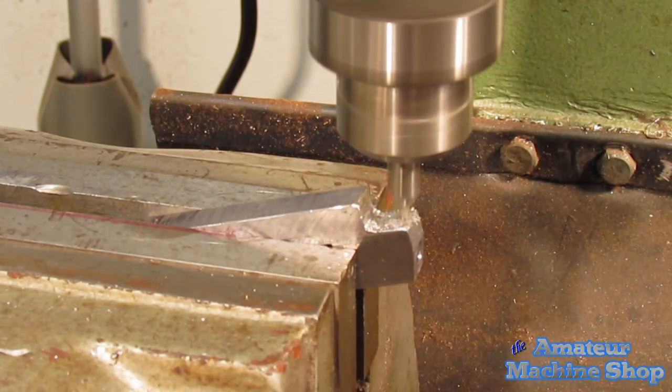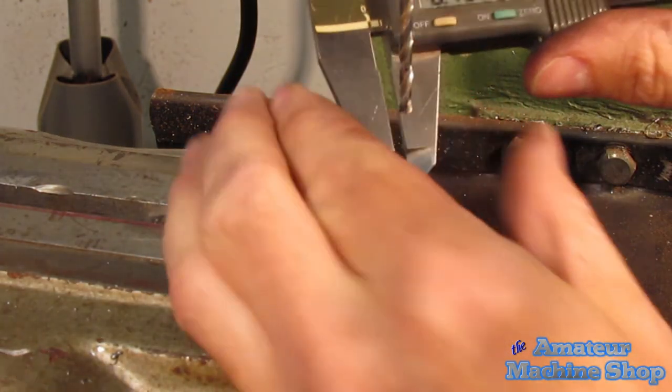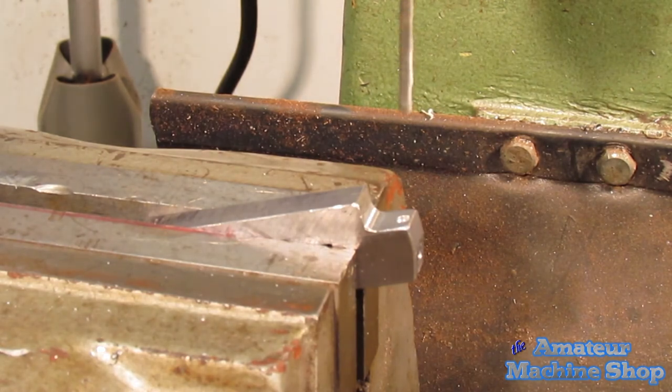I currently do not have 1/8 or 1/4 inch reamers, so I decided to use the right size drill bits. The fit is snug enough as long as the drill bit doesn't cut oversize, also ensure it's sharp and ground perfectly.